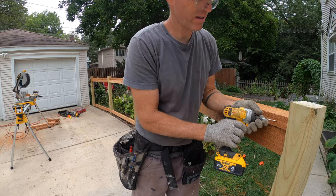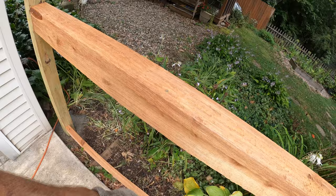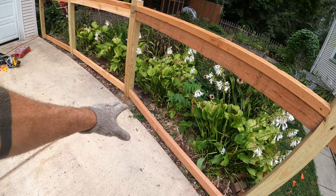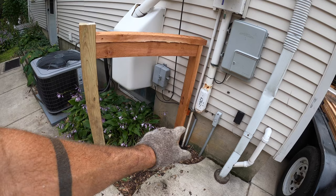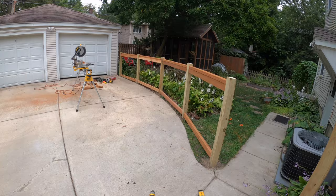Framing check — starting at this end. You've got your three rails in. These are triple-coated screws, just because there's going to be water here, screwed in flush. I'll probably put a little dab of sealant on these when done. Working on down the curve — you can kind of see the curve from this end — all level on top. The bottom ended up being level too; I thought it was going to be humped in the middle but it ended up just being level, no problem. I did a not-too-deep cedar 2x4 on this side to tie it together. Next steps: caps, gate, pickets.